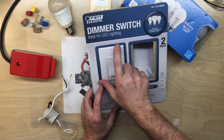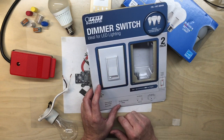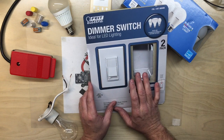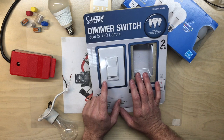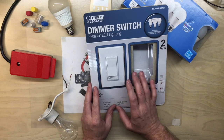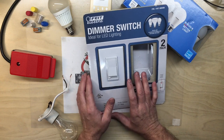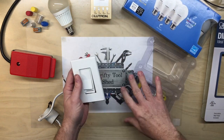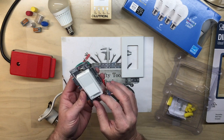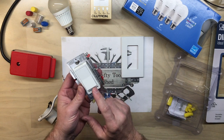It says ideal for LED lighting, and originally I even bought the LED dimmable bulbs from Feit also. At the same visit I installed one in the breakfast room area that I had a dimmer on, so I replaced the incandescent bulbs with LEDs and put the correct dimmer in for the LEDs. The problem with this dimmer, once I installed it, is that although it wasn't a big issue, it would cut on and off fine up high.